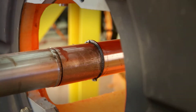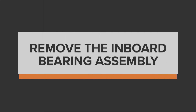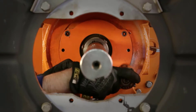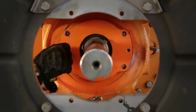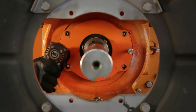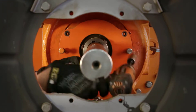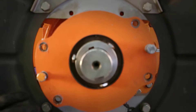Remove the key and then remove the snap ring. Loosen and remove the four bolts holding the inboard bearing assembly. Use two of the bolts as jacking bolts in the tapped holes, one on each side. Carefully jack the bearing flange off the mixer, bringing it off the shaft. Only move a little on each side at a time. If two people are moving the assembly, each can crank on opposite sides. With the bearing housing loose, remove the bolts and pull the housing out the back of the mixer.